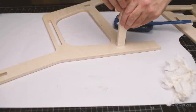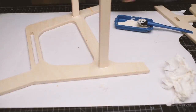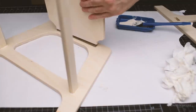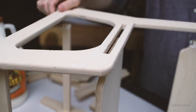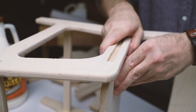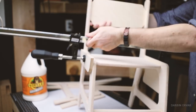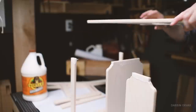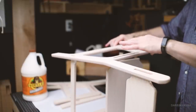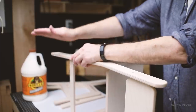In terms of assembling the chair, it's pretty straightforward. It's a good idea to sand all the pieces first. Then simply lay down one of the chair sides, add glue to the pockets and the pieces fitting into them, fit them into place, add glue to the other side, and then fit the last section on. You may need a little gentle force, and it's nice to use a clamp to make sure all the sections are gluing together properly. I made the slots to be exactly half inch high, and half inch Baltic birch is more like 0.485 inches thick — but that discrepancy turns out to be quite perfect: not too tight, just enough room for a good fit. Just make sure you don't sand those ends down too far.